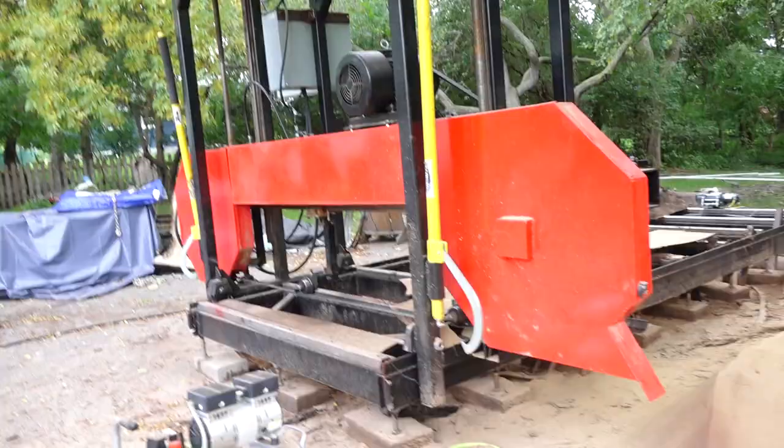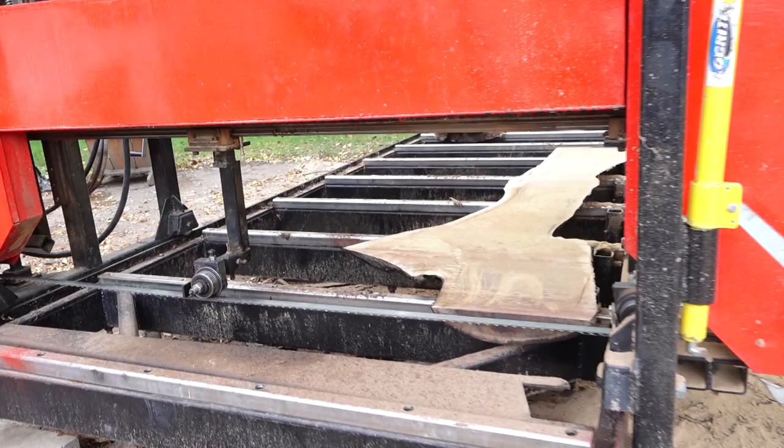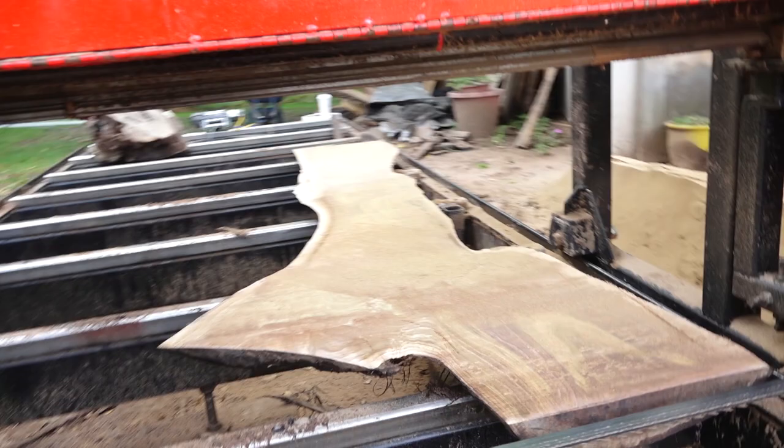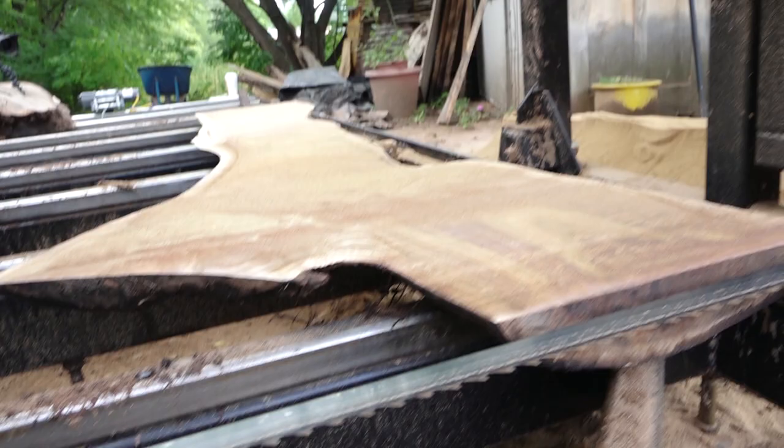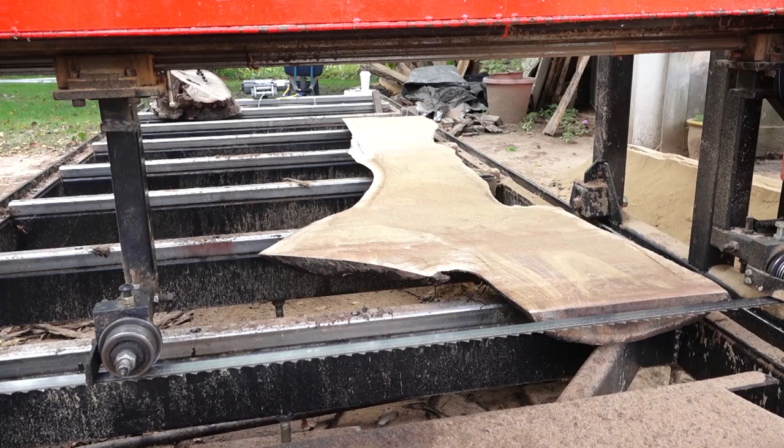So to answer a couple of common questions, normally people ask how long these blades last. If I hit a nail or something, obviously that's going to throw things off, but we've made 37 cuts in this log with this one blade, and it's getting a little tired now. This is probably where you would switch out this blade normally, especially if you're cutting this wide. It's not too bad down there, but up here in this wider crotch area, it definitely seems to be lagging. So I call that your typical blade life for one of these blades, and these are just basic carbon steel blades that are $48.